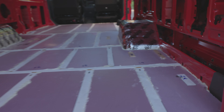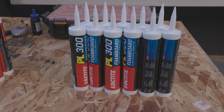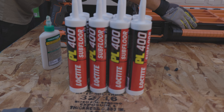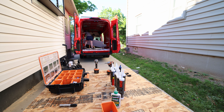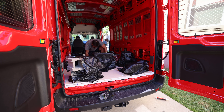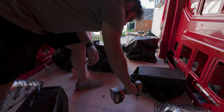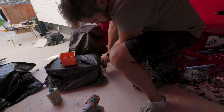We just trimmed all of the foam, and the next step with the subfloor is to glue and screw. The adhesives we're using are Loctite PL 300 foam board for foam-to-plywood, and Loctite PL 400 subfloor adhesive for ribs-to-plywood. We glued down all the plywood before we started to screw anything in. If we could do it again, we'd probably glue and screw as we go for each sheet of plywood, because by waiting until we did all the pieces, the glue started to get tacky and our screws couldn't push down quite as far as we wanted. Glue and screw piece by piece is the way to go.